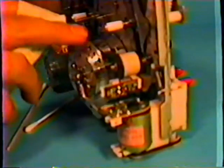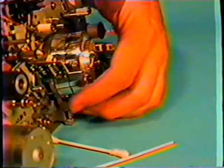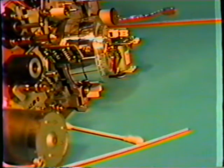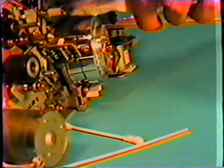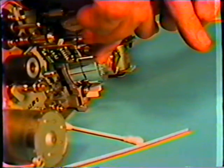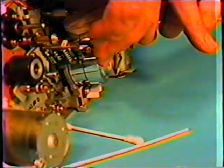That's why when I'm cleaning a head on a machine, what I like to do is, as you can see, there's the part that spins and there's a part that's fixed. Let me turn it a different angle here so you can see it a little differently. You see the part that spins and the part that's fixed. I like to put my finger where the majority of it is on the fixed part, so that as I spin it, I don't put any pressure on the head assembly, on the active element of the head. I lay my finger right there, lengthwise across. If I put any pressure at all, it's on the back one. So you're just lightly touching the assembly, and you turn it very slowly. That's actually cleaning the head.